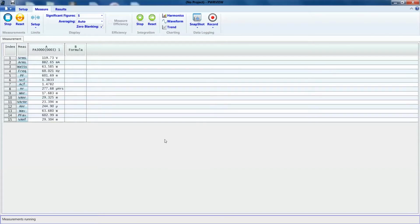While the measurements are running, let's calculate how much this is going to cost us in dollars or cents, right? The average cost of an electric unit, the kilowatt hour, in California is about 15 cents, as I just mentioned, right? Let's go to the formula column and multiply the unit cost with measured energy consumption, right? And since the unit is in kilowatt hours, I'm going to divide it by 1,000, right? There you go. This will give us the exact cost of operating this open fridge for over 10 minutes.